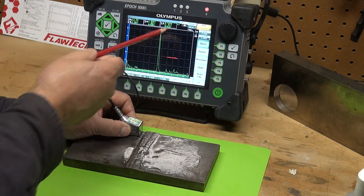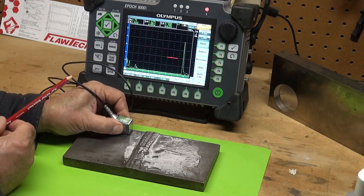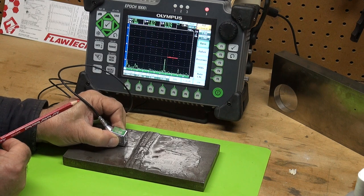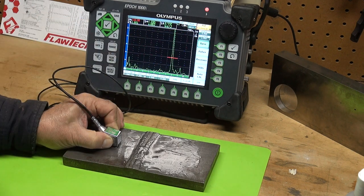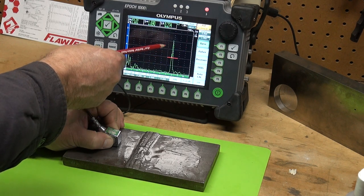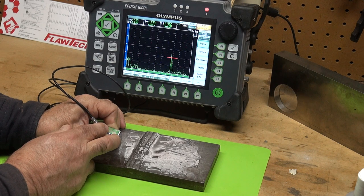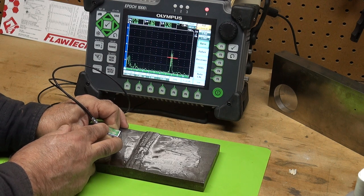My range is set at two and a half inches — that's my root pullback. This is a clean section of the weld, and there's the toe of my weld, so those are normal geometry. Scanning over here, I added 6 dB to my reference level, and right there is my sidewall fusion crack. We can see how it differs from lack of fusion — it somewhat seals and the facets kind of escalate in an escalator-type pattern.